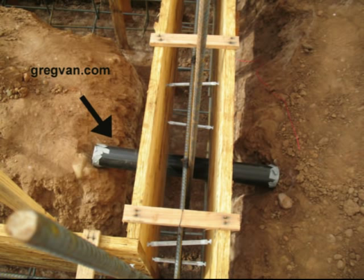Sometimes when they're pouring the concrete, they will actually pour it on top when they're filling up their stem walls, and the concrete will spill over. Sometimes these pipes get buried. I'm sure that the plumber has a measurement and they know exactly where the pipe is. But if they do get buried, if it was a little longer in the dirt and you put some dirt over it, or even some cardboard over it, something like that, it would make it a little easier sometimes to find it.